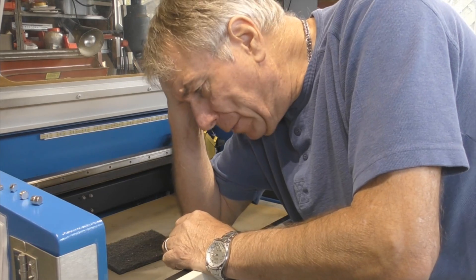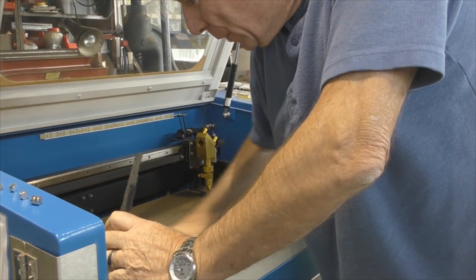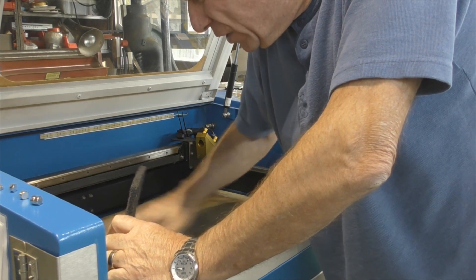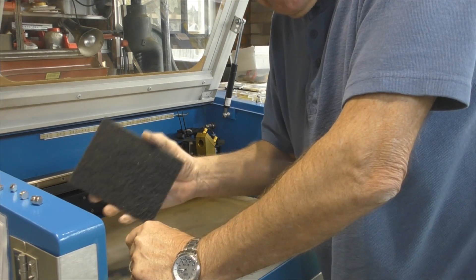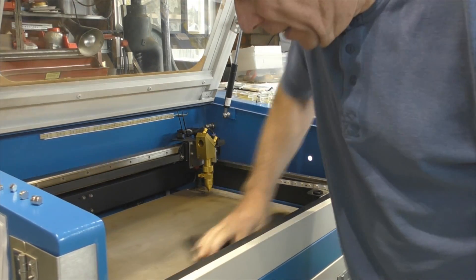Welcome to another RD Works Learning Lab. Today I've been doing a little housework - cutting acrylic on here, and the condensate sticky goo has finished up bonding to the surface, so I've had to be a little bit more aggressive than acetone. Because I've got a steel base plate on here, I can't really do it any harm.